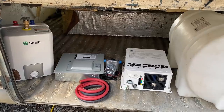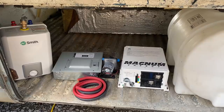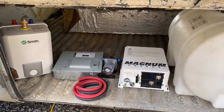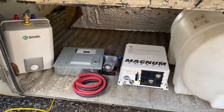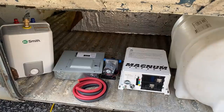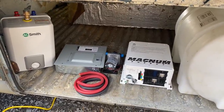So with 4 of them, they're 100 amp hours each, but because you can drain them down to near zero with the BMS, the BMS prevents the battery from actually going below. You buy like a 100 amp hour battery, it's actually like 110 amp hours, but you can use the 100 amp hours out of it, and that extra 10 stops it from being completely depleted internally, which is very bad for the lithiums as well as lead acid, which obviously lead acid you can't go below 50%.